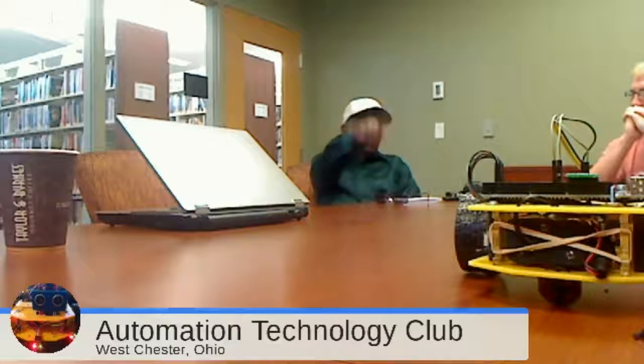If you remember when I did the class, I had it updating every cycle. It's still doing that. It's still getting the information and still running through the cycle every single time. But it only really changes anything if you send it something new, like if something comes in from the ultrasonic sensor. It's doing a speed control, set right now to roll 500 milliseconds and then technically stop, but it doesn't, because it's constantly getting updated.